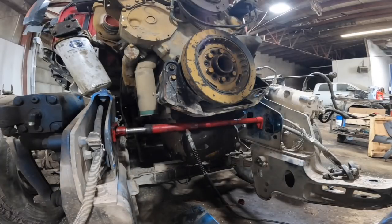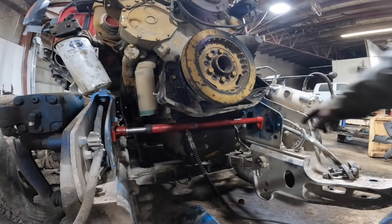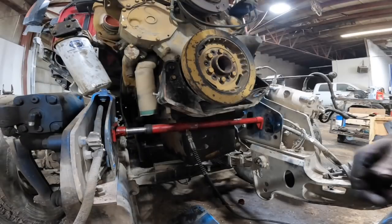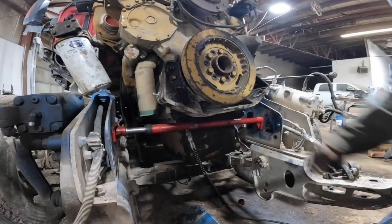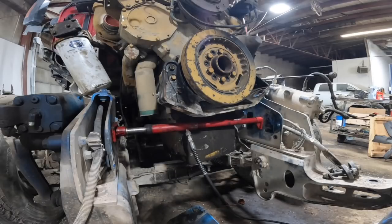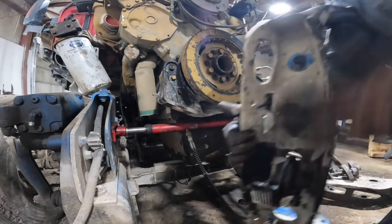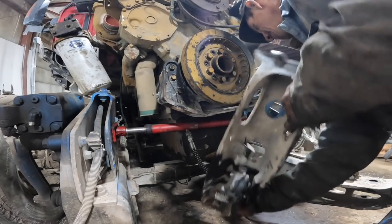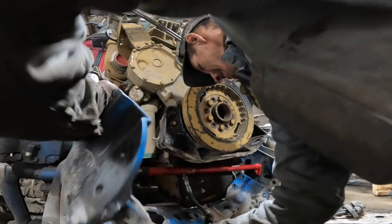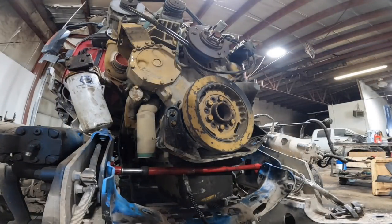So what I had to do here when I pulled this engine out is I could not get it angled enough. I probably could have done it if I had pulled the pan off the old engine too and pulled the pan off this one. Because you kind of have to pick from the center, because I'm on one of the Jake brake studs right now in the middle of the engine with one of my lifting eyes. You can't get a hold of the lifting eye in the back, there's no way you would with a spreader bar, because half the engine's underneath the cab. So you got to get it angled enough. And I still couldn't get it out when I pulled it originally without pulling this front mount cross member that the actual engine mount for the front sets on.